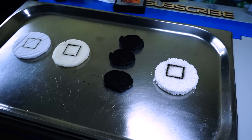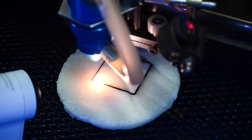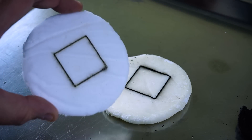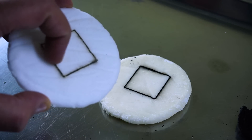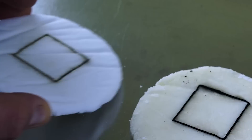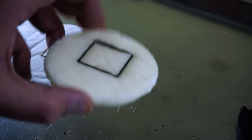Experiment one is done — I tried to cut a square at maximum output power, around 35 watts on the K40, at a slow cutting speed of 5 mm per second. We have visual markings on all samples as expected, but could the laser beam penetrate the material? On the first sample we can see some markings and a light ridge when I scrape with my finger — so we have some minor penetration. When the material carbonizes at the impact point, the carbon acts as a shield to protect the underlying material. You can see in the macro shot there are sprinkles of carbon, but the carbon layer is not consistent, meaning on a third and fourth pass the laser keeps penetrating deeper. The second sample looks less promising at first — there is a deeper groove approximately 0.5 mm deep — but on the macro you can clearly see a continuous layer of carbon, making it much harder to penetrate further. Very interesting.